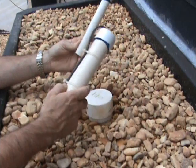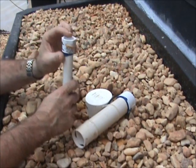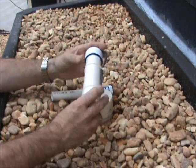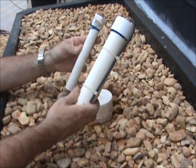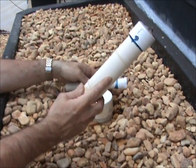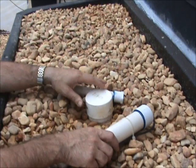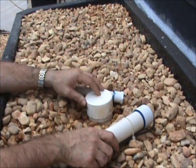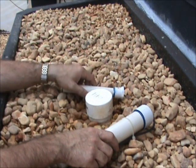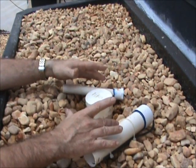This is like a three-quarter inch piece of pipe with just a three-quarter inch fitting on top — it just gives it a little more of a rounded edge. You want to go up one size in pipe: if this is three-quarter inch, you'll want to go with an inch pipe. And then the outside screen needs to be about a three or four inch pipe. I put a three inch on mine, but it's really better to have a four inch — that's what I had on hand, but four inch works better and gives you a little more room. It's just a screen, so you can make it as big as you like.